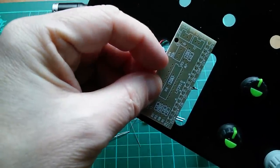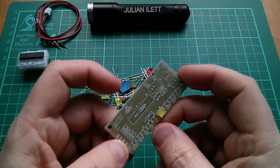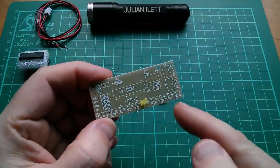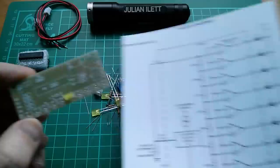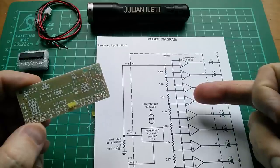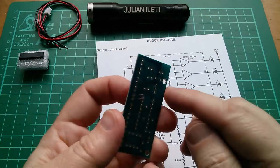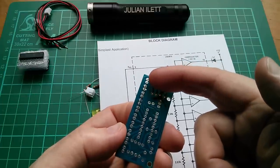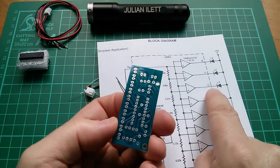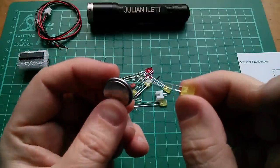The first issue is which way around the LEDs go. They're marked positive on one end with a vague hint of an arrow. If we bring in a block diagram from the datasheet of the LM3915, we can see the LED pointing that way. Positive indicates the most positive side of the LEDs, and if we flip the board over, the positives are all common together on one line, and the cathodes are routed into the pins of the chip.